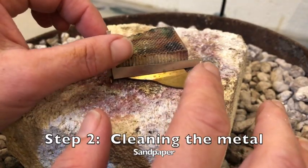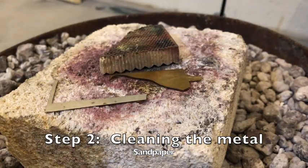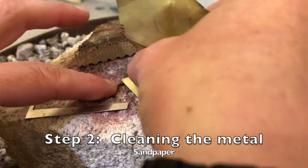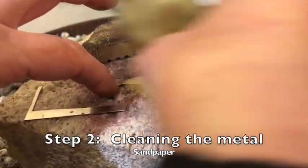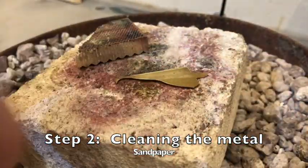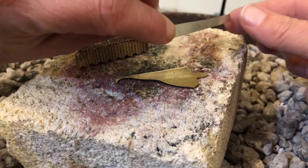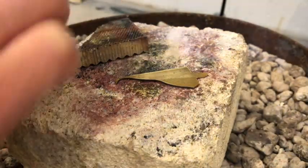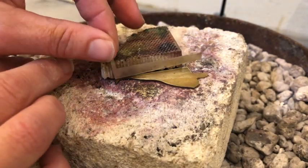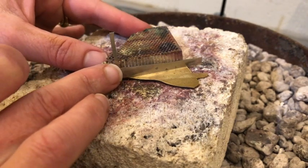I'm going to adjust it a little bit, but I'm going to wait on that because I have to do the second step anyways. So second step is cleaning the joint. Cleaning is just removing any dirt or oxides off of the surface. If you're repeating soldering, sometimes that's letting it sit in a pickle for a little bit and then cleaning it up. So I've sanded both surfaces. I'm doing the best I can not to use my hands to touch those 2 places, and I'm using my propping tool to rest that up again.